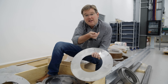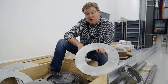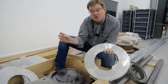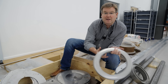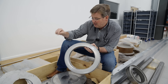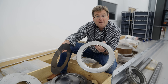The flat rear face of the annular combustor is formed using a pressing process where we take a ring of flat superalloy material and then produce a male and female press tool that provide the shape we want — to accept the fuel injection nozzles. We sandwich the sheet metal between the male and female tool and press out the form that we need, then cut off the excess before it gets welded into the rest of the assembly. We've now developed all of these press tools and made the first pressings — there's still a little bit of process development to do, but they're good enough for the prototype engine.